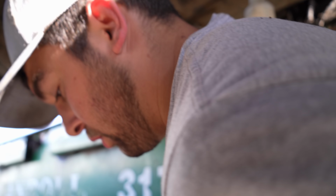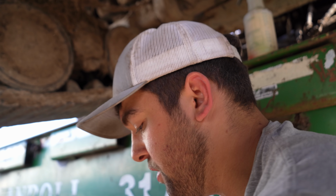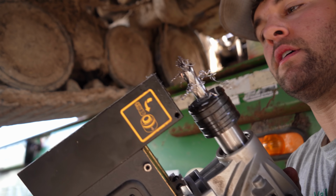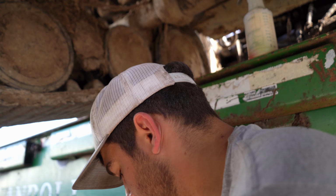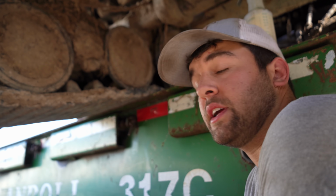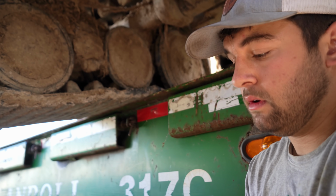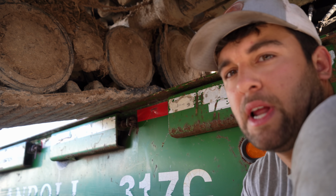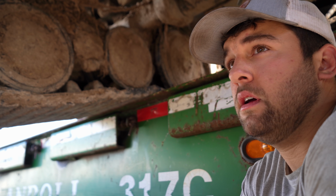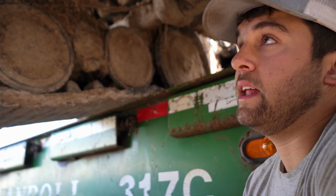Okay, so we changed plans a little bit after that cutter broke. Went ahead and we stepped up to a 11/16 cutter. You see, I just did 1 hole. Bumped up to the 11/16, so that way it completely cleared that leftover easy out. It went all the way around there without ever interfering with it, so it wouldn't break. That's what happened on the last one, was that that 7/16 cutter got a hold of that easy out, and it did not like that at all.